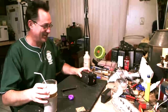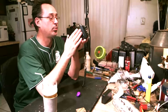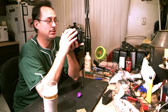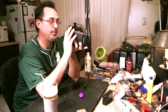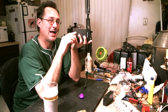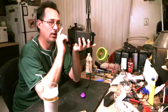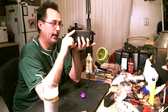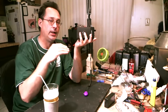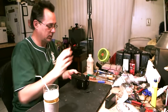So yeah, it's the Barbie Glam Jet PA. What I did with the circuit - usually when I'm trying to do something with a toy like this, or any curly keyboard that has a PT2399 chip in it, you look around for the resistors near the black blob, the main chip or the delay chip. I'll lick my finger, stick it on the resistor, and find the one that's the timing resistor - when you hit that you'll hear the pitch increase, or the echoes will change the delay time. Then you just remove that resistor and drop in a pot.